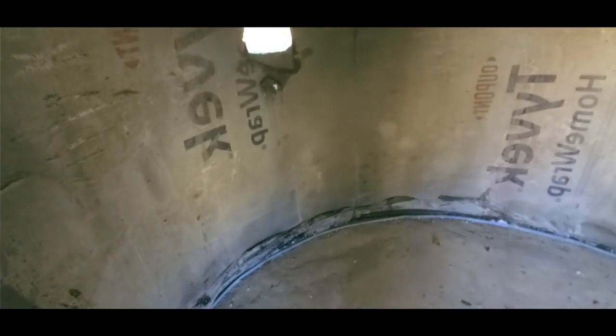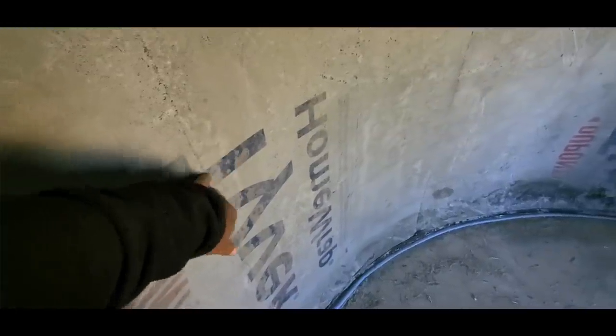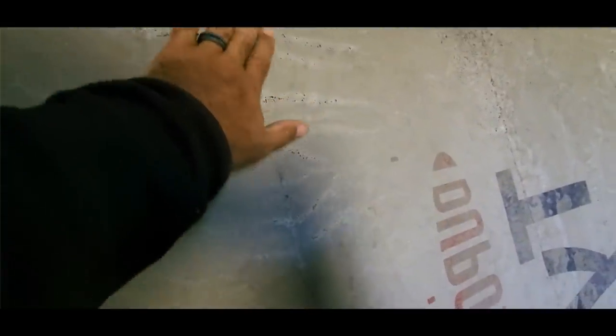The air form was mounted here, inflated, and then removed — this is just some of it stuck to the cement. The wall comes out extremely smooth because the Tyvek air form is so smooth that you have no finishing work to do on the inside. We do get some wrinkles, but these are easily plastered and made smooth. The majority of the wall is completely smooth — you could just paint and be done. There's no scraping, filing, or smoothing on the inside like a traditional aircrete dome, because this is a stucco shell — cement and sand — coming out perfectly smooth.